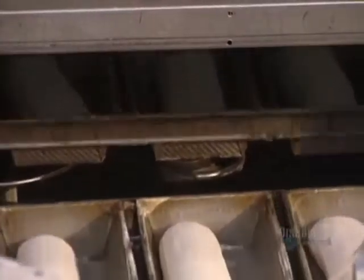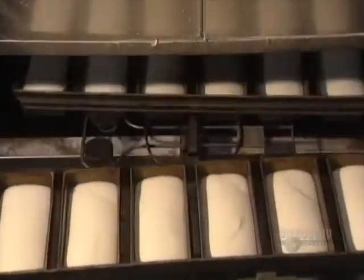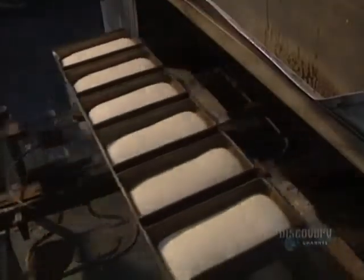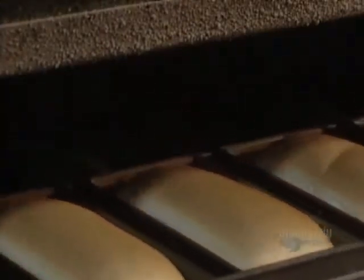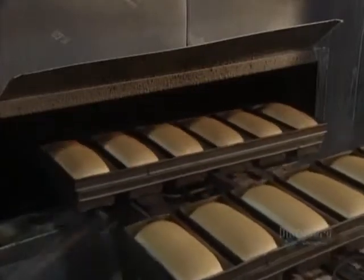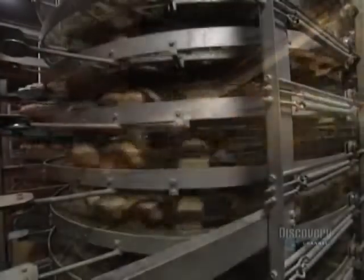Squatted down at the bottom of the molds, the dough pieces go into the prover, where they rise for an hour at 42 degrees centigrade and at 70% humidity. Then they bake for 20 minutes at 255 degrees. When finally baked, the loaves end up with a nice golden color. A vacuum system draws the loaves from their molds. They're then placed on a conveyor to cool.